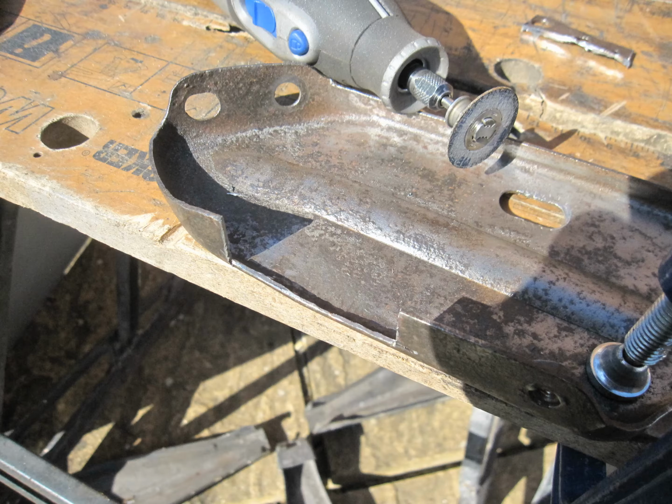With the repair plate clamped in place by the tabs, I've welded it in, then ground back the welds. On the inside of the panel, the tabs are still there. And now the welding's done, I've cut them away with the Dremel grinder from the repair area, which is here.